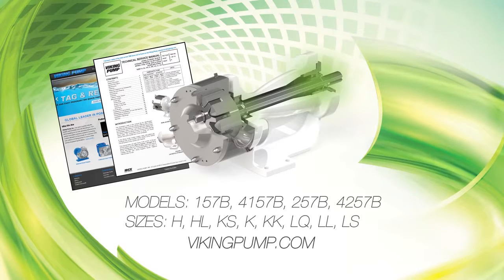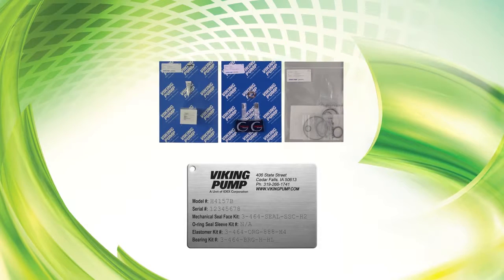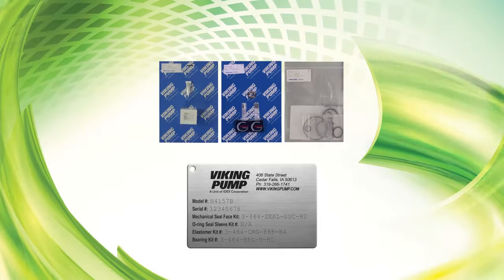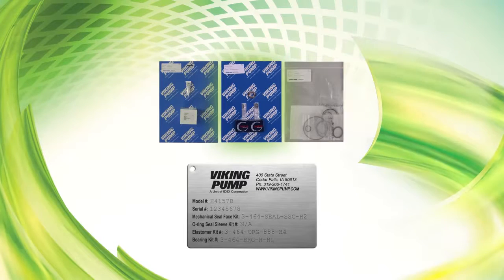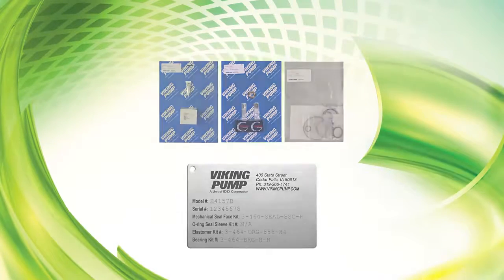The pumps covered in this video are Hygienic Series pumps with a focus on replacing the bearings. Seal face kit, bearing kit, and elastomer kit part numbers can be found on a hang tag on the pump. If the tag has been removed, contact your local authorized Viking pump distributor with the model and serial number of the pump to obtain these part kit numbers. The bearing kit includes the lock nut, inner bearing, outer bearing, cap screws, and set screws for the pump bearing.